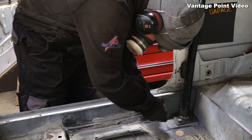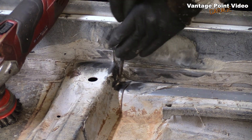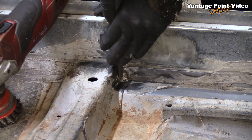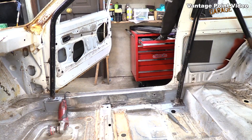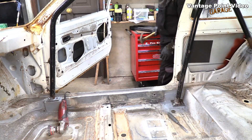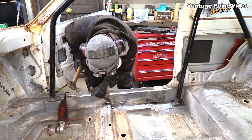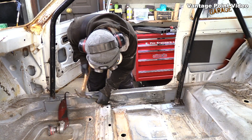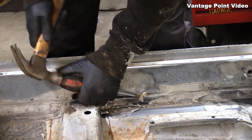For the moment I can explain that I'm following the 2023 drawings from the FIA for Group A, N, and RGT cars. The principle of the supports that will go under the seat brackets is that four bars will be welded across the car. They will have end plates welded onto the ends of the bars.